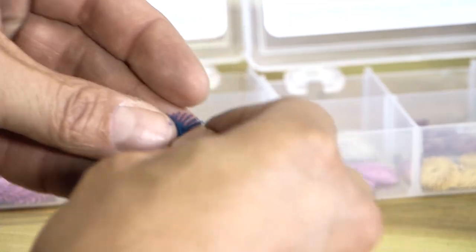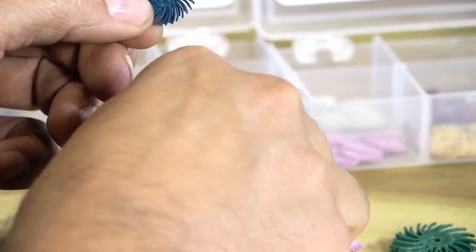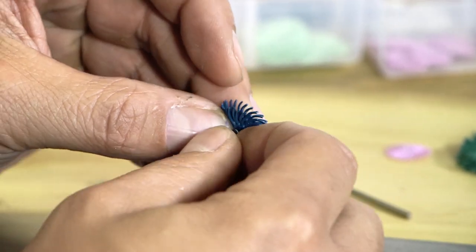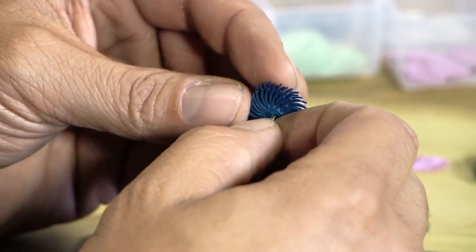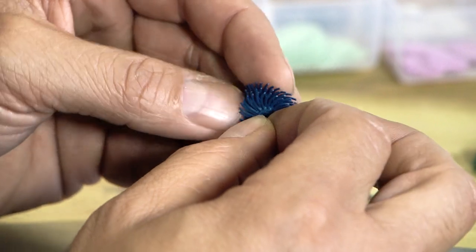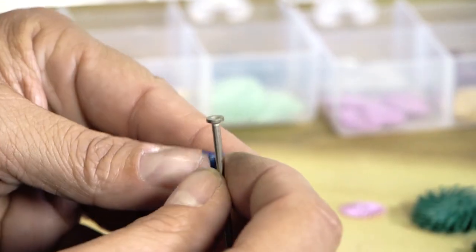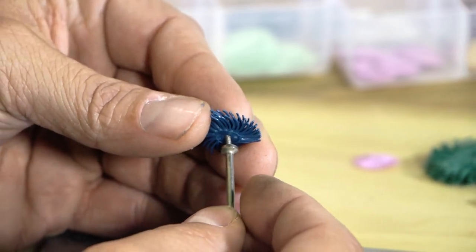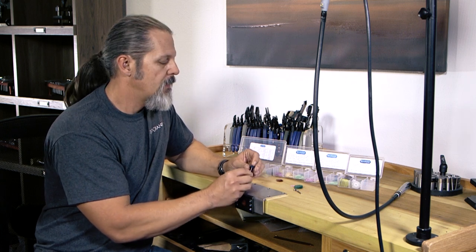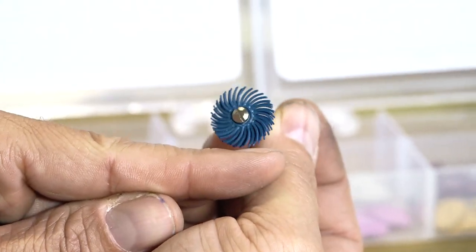So I'm going to take four layers like that and get all the bristles going in the same direction. Then I'm going to take the screw from the screw mandrel and slip it through there. This is always the hardest part — just trying to line all these little things up. Let's do one at a time. Okay, now I've got them on there and I'll go ahead and take the screw mandrel and just screw that in by hand. There's no need to take a screwdriver or anything like that and tighten it down.